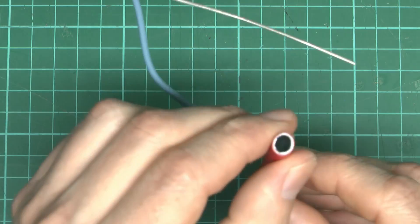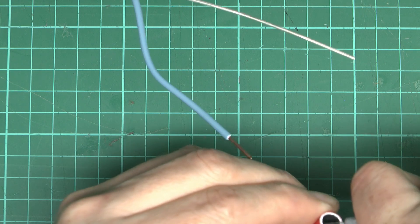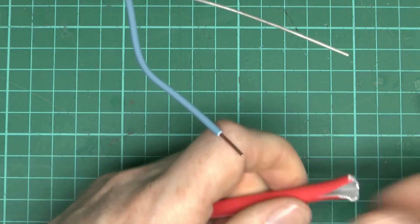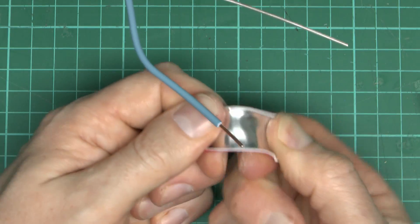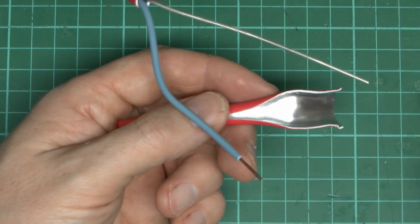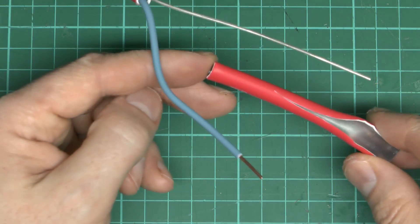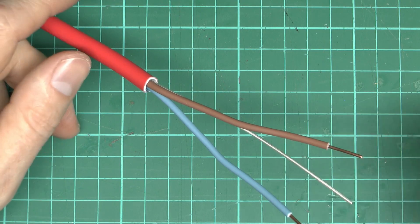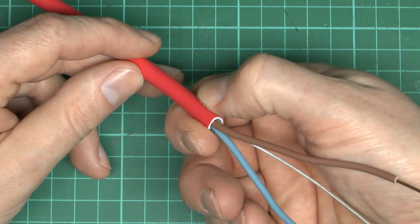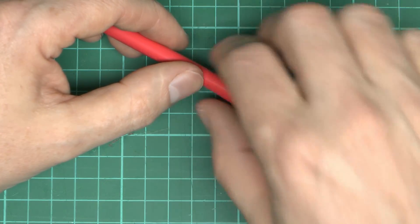This bare conductor is actually bare because inside the outer covering there's a metallised covering on the inside. If we split this open, we can see it is actually a metal interior. So this bare conductor is basically in contact with that the whole time, meaning the entire outer metallised covering is part of the circuit through the entire length. In terms of actually connecting this up, there's no mystery — it's pretty much the same as any other cable. You strip the appropriate length and attach it to the various terminals. There are glands you can get which fit around this, normally coloured red or white, that fit around the end and tighten down to secure into an enclosure hole.